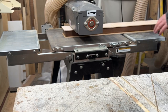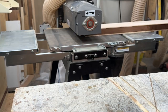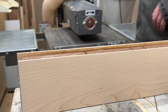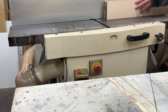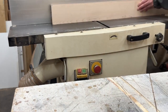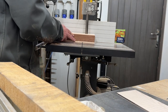After you've got the sandwich all glued up, I just run it quickly through the drum sander and scrape off any bits of glue, then run the two edges through the planer to create a flat square parallel sandwich so that I can then use that for the long width of the coaster. Once I've got that, I cut the piece in half.